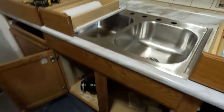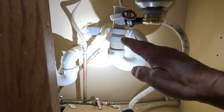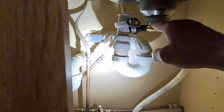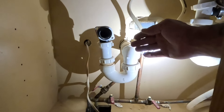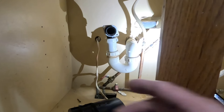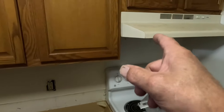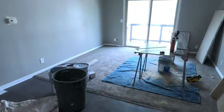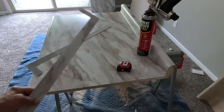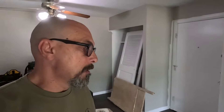I've got a list of steps and stuff I need for the sink. I have to redo the drain — the P-trap line is tipped down and it's too close. So I'm gonna cut it off back there and put the garbage disposal on this side of the sink, put the drain on the other side, do a cross pipe drop down, put a wire end on the garbage disposal. I also need a piece of trim, a 10-inch microwave, and my heat gun to glue the sides on the countertop.